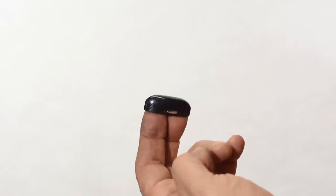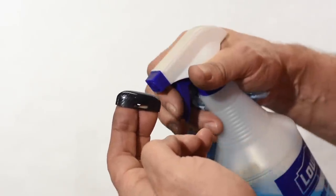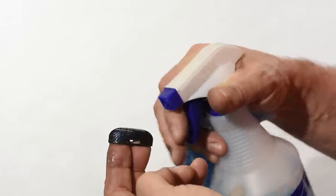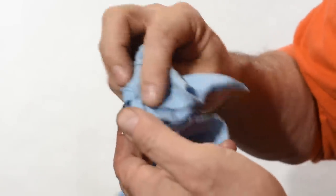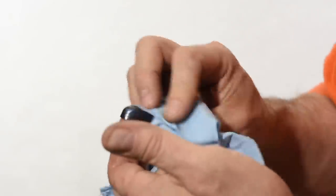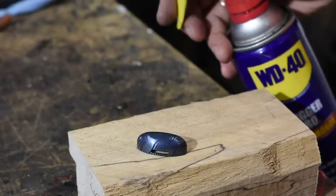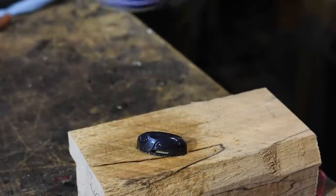After quenching, I'll wash my parts in hot water — not just cold water, hot water — to dissolve any remaining salts. You don't want any of that salt hiding in cracks and crevices, as it can cause problems with other parts of your knife down the line. I do a final cleaning with Windex, rinse them off with hot water, dry them, and then coat them with WD-40.